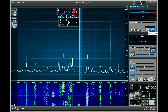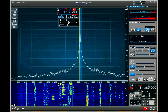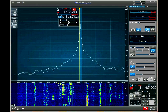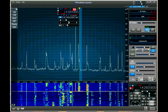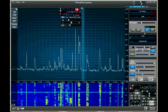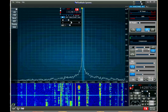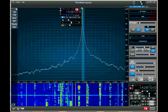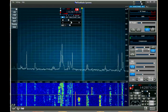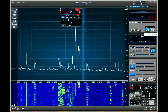It seems to go from a complete scratch tune — a full 10-second tune every time you hit it. I don't think there are memories in there like there are on the 3000/5000 series; that may be added later. But if I go to pretty much the same frequency and hit that tuner again, we get a full 10-second tune before it locks. When it does lock and it's successful, you'll see it says 'success' right above the ATU button. If it fails, it'll say 'fail.' If your antenna is already resonant, it may just say 'abort' or not do the tune. Your bypass is just bypassing the tuner.